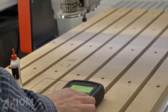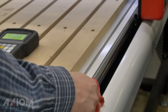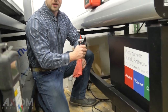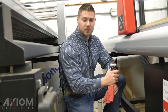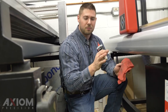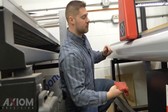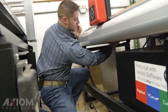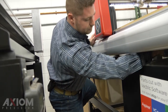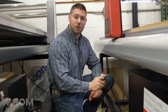After you've jogged the gantry out of the way, your prismatic guides are going to be located on the side of your table. Go ahead and saturate that rag again and wipe them down. Getting underneath the machine to lubricate the Y-axis ball screw can sometimes be a problem, so if you have a stand like this it keeps the underside of the machine available for any maintenance procedures. The ball screw on the Y-axis is going to be located in the center of the machine, so we can just reach under and wipe it down. Now our topical lubrication has been applied and we're ready to get going.